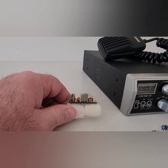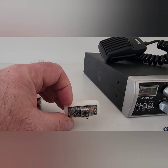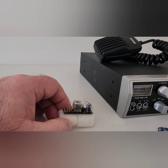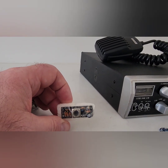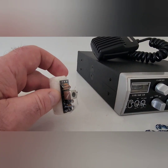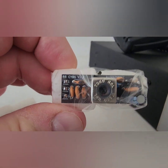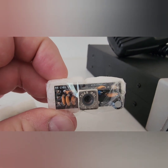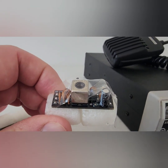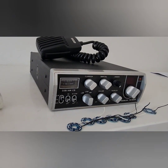But it's a triple layer board. It has an RF layer on the second layer, protected, and it's a very stable device. I've used them on all my CyberNet radios and never had a fail, never had any quirky things happen, never had any RF interference. There's quite a bit of science gone into this product. So there you go. He makes two VCOs, one for the GEB model to replace the green box, and this one is for the CyberNet Mark I, which of course this is.